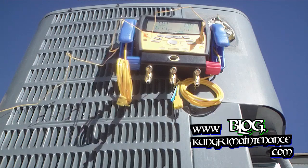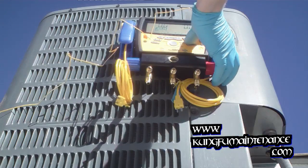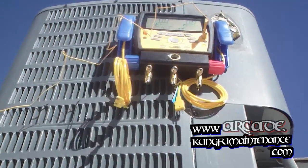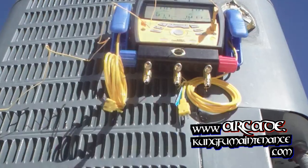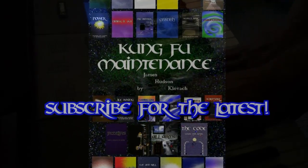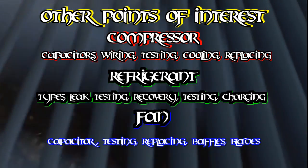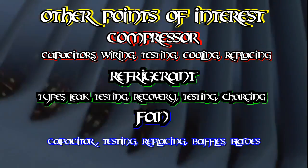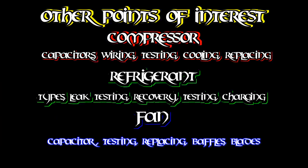The heat is coming. Now we're going to lock that in, just going to hit enter. So indoor wet bulb was 64.4, outdoor dry bulb 104.1.